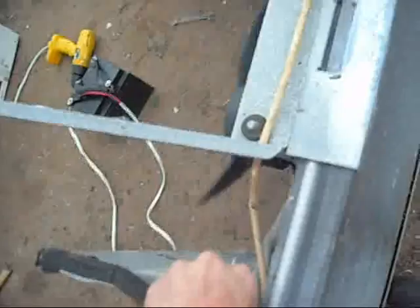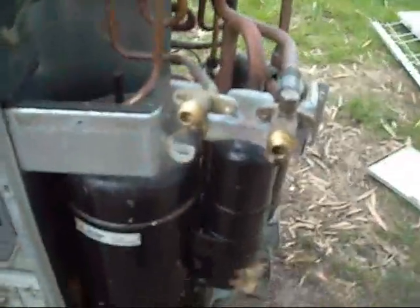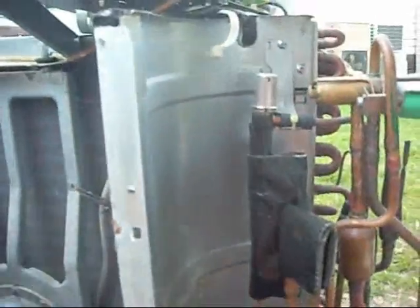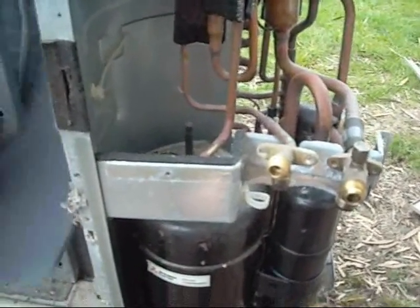The EEV — like a stepping motor. That's the expansion valve coming out through here — that's the liquid out, or evaporation out. It's all liquid feed up to here and then it's always evaporating until it gets to the indoor unit. I think it's a noise issue — you don't hear the hissing of the expansion valve if it's in the outdoor unit. If it was inside you'd hear a bit of a hissing and surging sound as it starts up and shuts down. So it's not a bad idea.